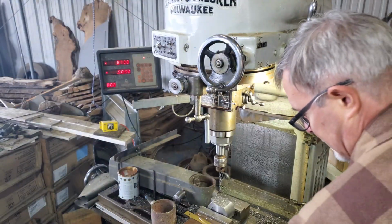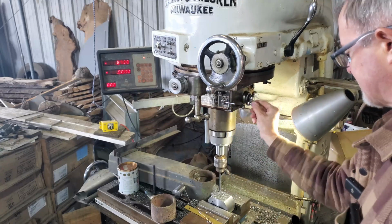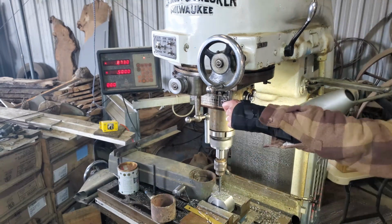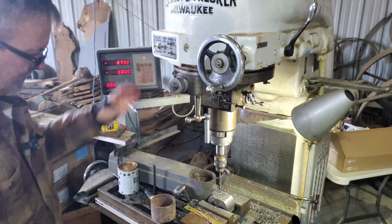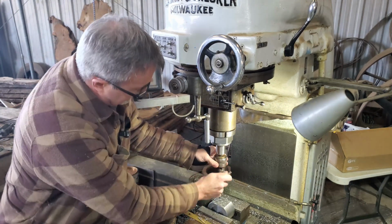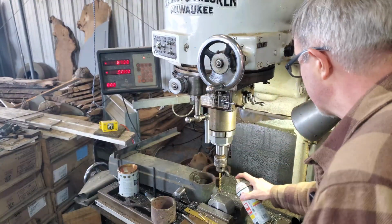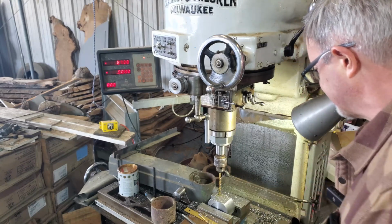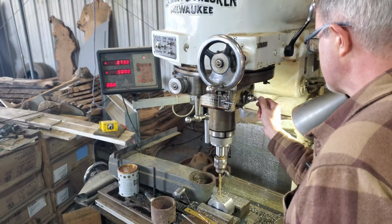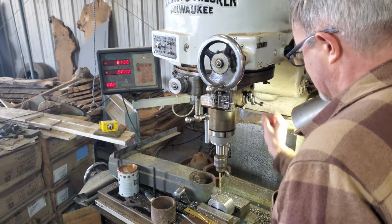Let's slow this down a bit. I think that's about the last hole that drill's going to do without a regrind. I'm going to do maybe 1/4 inch at 3/8. That'll help me start the tap straight. I won't have to tap as far. Did 300 thousandths.